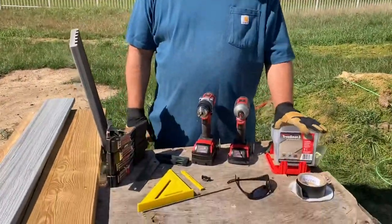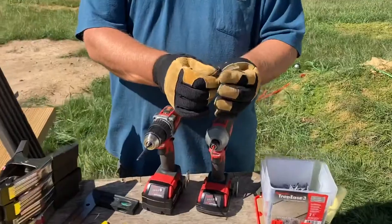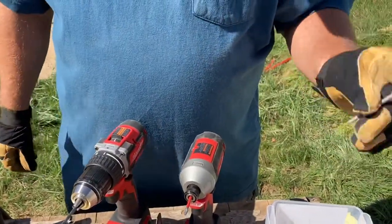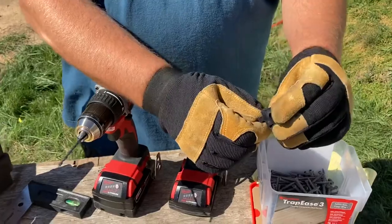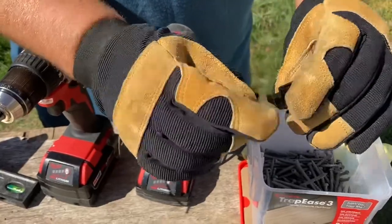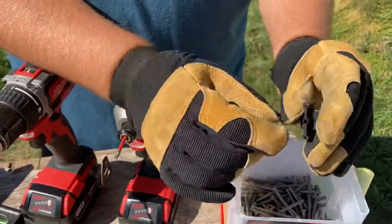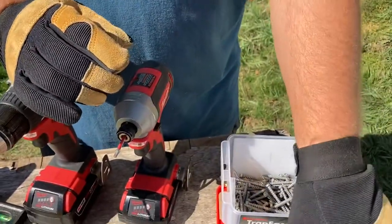You need some good composite deck screws — they're different than normal decking screws, designed specifically for composite material. You'll notice the threads go one direction and then at the very end they reverse direction; that's to lock them in. They're color-coded to your decking material. This is a hidden fastener for Trex decking — it gives us the gap we can measure to determine the appropriate gap between deck seams for drainage. I've pre-measured this and it's one quarter of an inch.